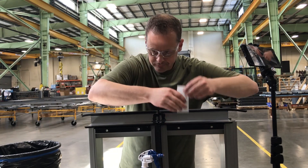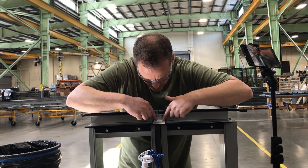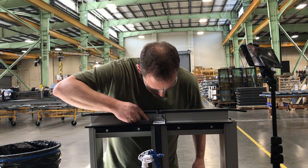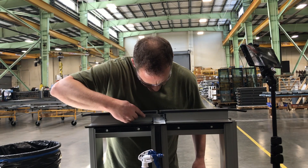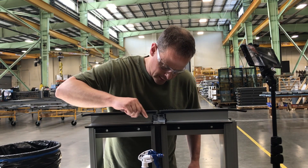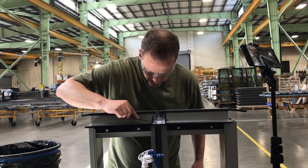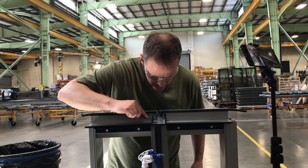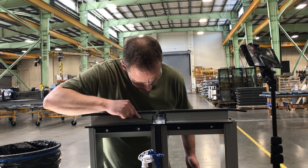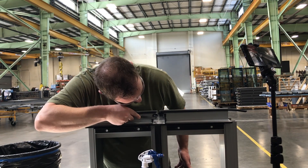Time to install the boot. We're going to press it right into the caulking and get it started. As you can see, I've got all the caulking underneath the boot. I'm going to use a tool to make sure I've got adhesion — pressing it down. I don't want to press out all the material, but I want to keep it flat enough so the unit is going to fit over the top. Pressing it into the corner, making sure I have sealant all the way around. We use a clear boot for this purpose — you can actually see the black silicone through the boot, which makes it real nice. Now we've seated the boot into the bed of silicone, and I'm going to make sure this area underneath the bulb gasket is tucked in nice — that can easily get forgotten.